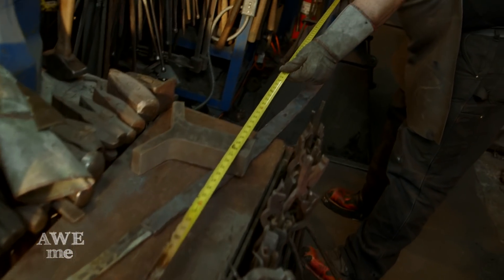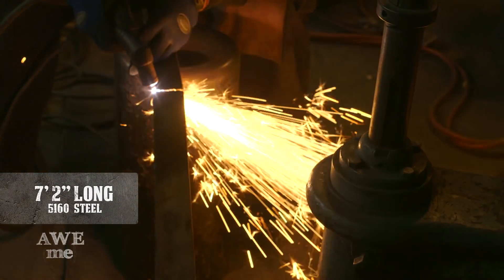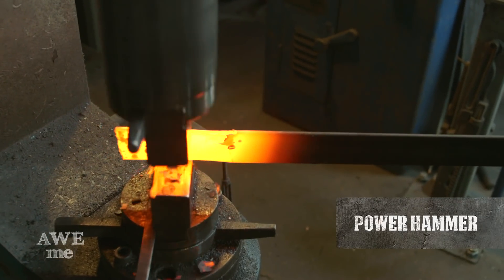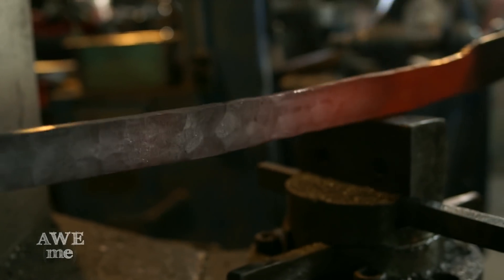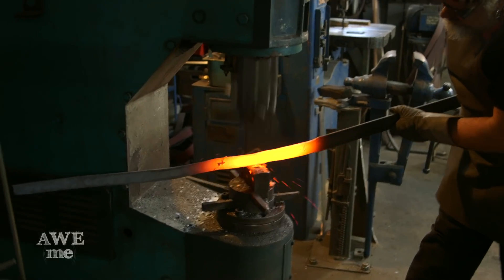Anything from Final Fantasy is just way too massive. Sephiroth's sword is this 7-foot-2-inch length of 5160 steel that I've been wrestling with for days. I started off with a 60-inch length of quarter-inch thick steel, forged it out underneath the power hammer, squashed it on edge to make it about an inch and a half to an inch and three quarters wide, and drew it out — that's a blacksmithing term. Drawing metal is to actually spread it, make it longer. The overall length of this piece is going to be 84 inches. It's been kind of fun with a red-hot piece of metal flopping around underneath the power hammer trying to keep everything true.